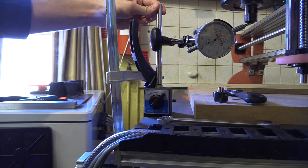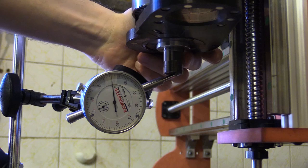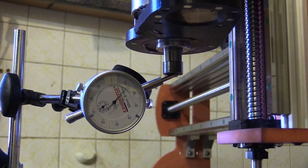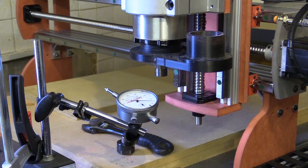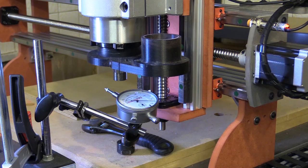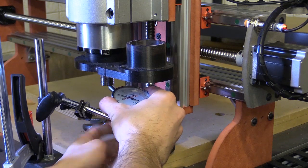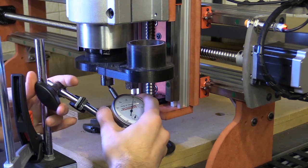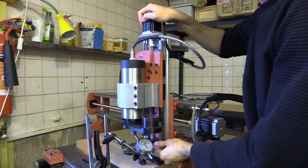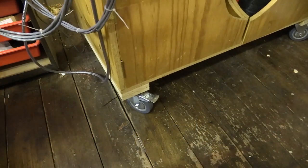Deflection is hard to measure because it's a combination of movement and force needed to create that movement. You may notice it while drilling smaller diameter holes where there isn't enough time for the tool to remove material from the cut while plunging — in this case the tool may lift upwards and drop into the cut along the nod, making the entry look a little oval. I'm checking the deflection of the spindle using a dial gauge indicator pressed and zeroed on the collet's inner cone. If I rotate the collet the runout is minimal, and if I push the top of the spindle assembly by hand I can see the distance moved on the dial indicator. There's some twist in the assembly — naturally the Y axis is a lot worse than the X. You're looking at just over half a millimetre along the Y and 0.1mm along the X. There's not much you can do with the Y deflection other than recutting some of the plates in aluminium or building some additional bracing for the gantry. Providing you're sensible with your feeds while cutting you won't notice this in your finished pieces.